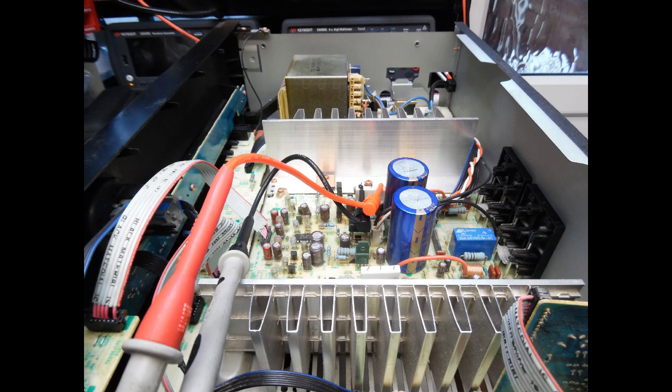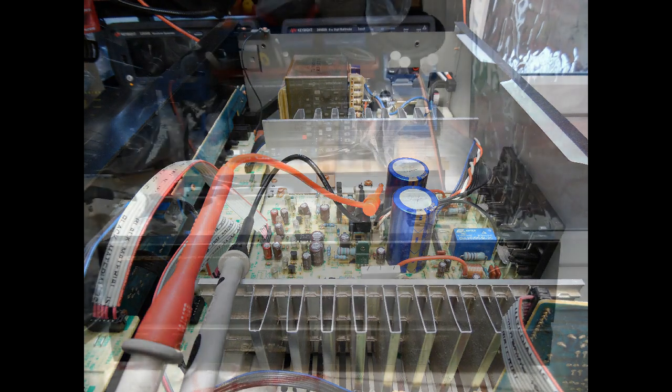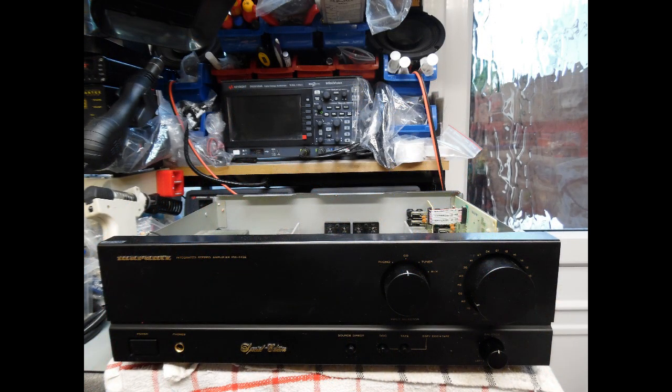Once adjusted to 14 millivolts, leave the amplifier running for about an hour, then run it under test with some test audio. You can connect a scope and run a sine wave, but based on experience you can often just use your ears to detect any distortion or crossover distortion. Once testing is done, clean up the amplifier — use a UPVC-type plastic-based non-aggressive cleaner first, then a secondary cleaner to remove any grease from the case.